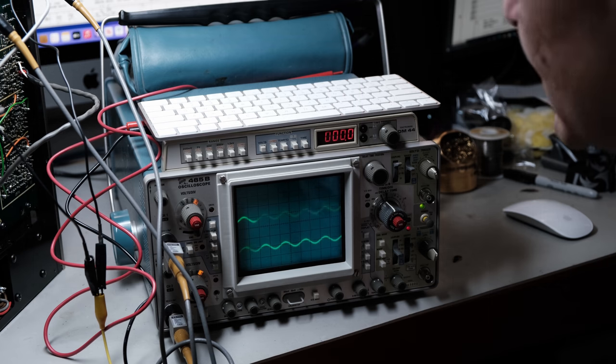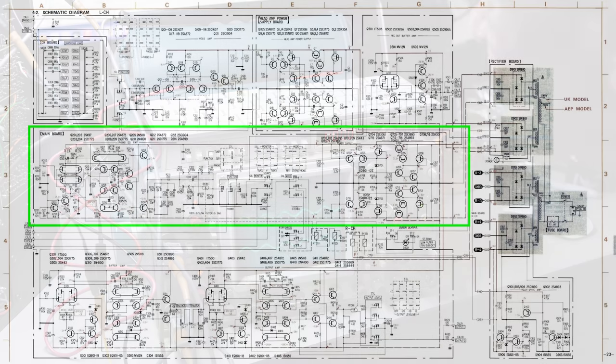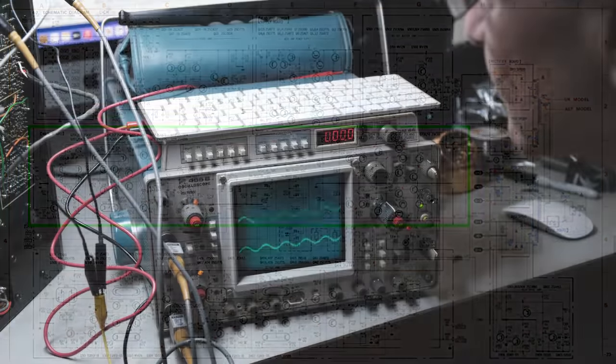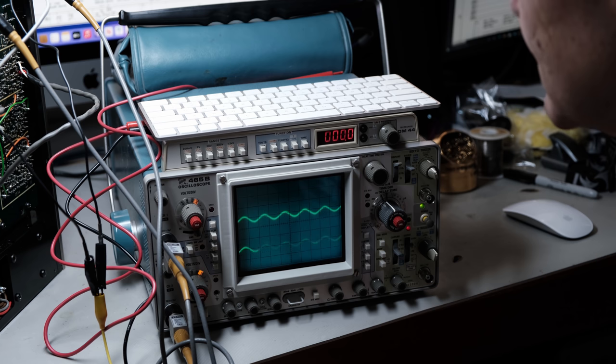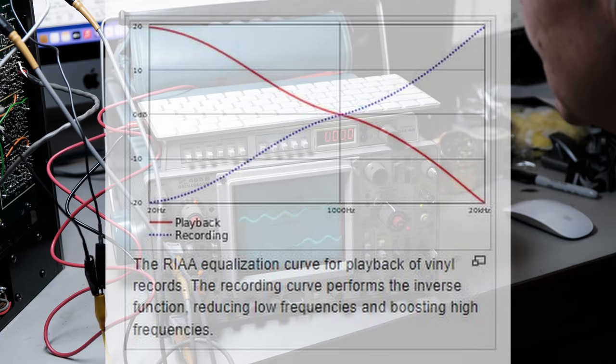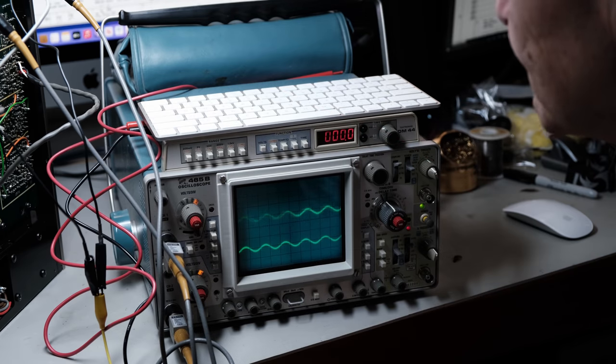But I'm going to go ahead and go to what they call the main board, which is where this signal comes into, and it's amplified. It's the Phono EQ amp of the preamp, right? They do this EQ thing when they make albums, and any preamplifier has to have a Phono EQ in it so you can listen to your albums. So it's actually the Phono EQ amp that I'm going to look at with it coming in.